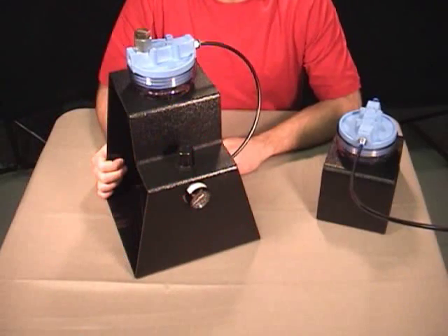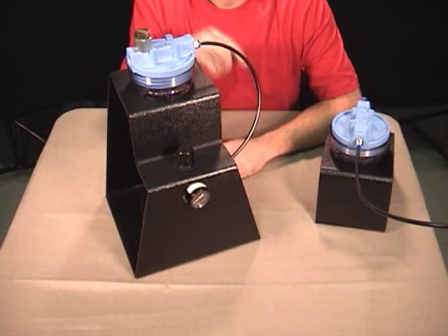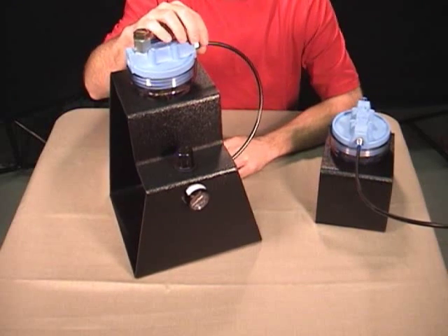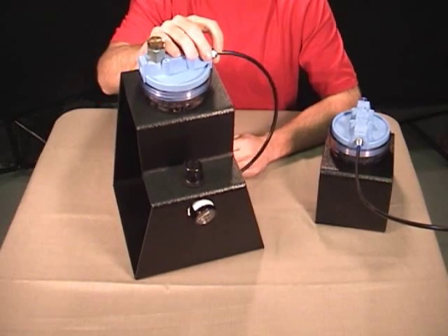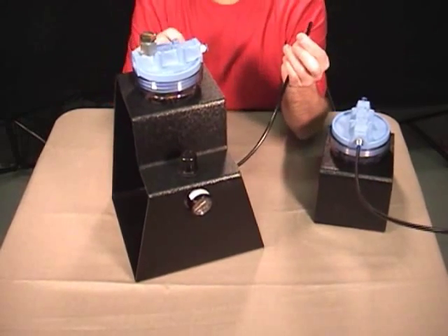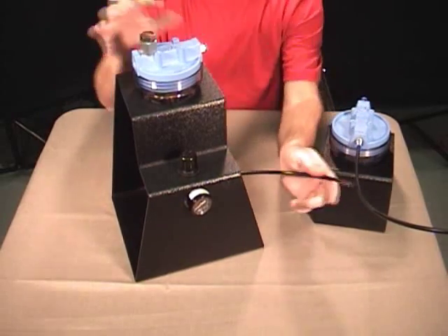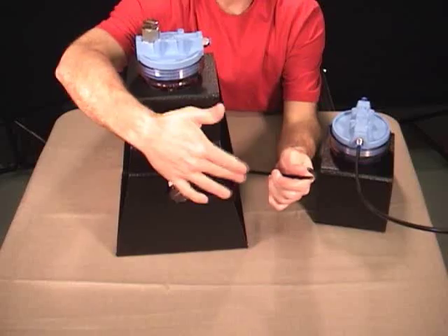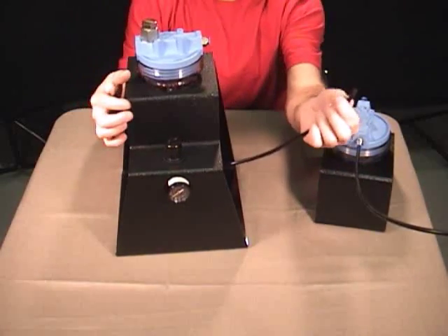Let's take a look at how we're going to connect our desiccant filter up to the pressure pot on the para-blaster. It's very simple. First thing we do is pull back on the ring on the lid of the pressure pot and slide the tubing out. I'm pulling the ring back towards the lid and sliding the tubing out. That tubing is coming from the back of my regulator and coming up to the lid, so now it's coming back from the regulator and I have it undone.